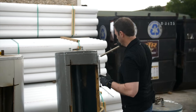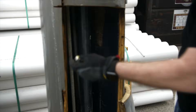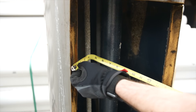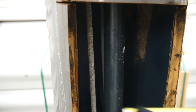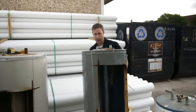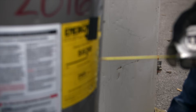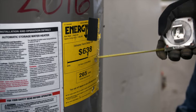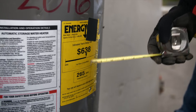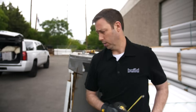The other interesting thing about this tank was the wall thickness — quite a bit less thick than the last tank. Let's measure it: it's just shy of an inch and a half, probably inch and a quarter in insulation thickness. I looked up the specs on this one — it has a 0.56 EF rating. If you look at the energy guide on the back, the most interesting thing — forget the exact numbers, this is a propane tank — is the scale from least to most energy used. This tank falls in the upper half, and I have a feeling that's a combination of insulation and burner efficiency.